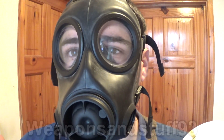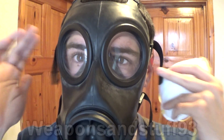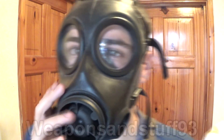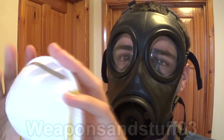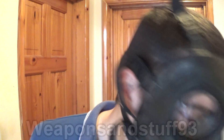Air follows the path of least resistance. With something like this, when you've got a filter on one or both sides and a really good weld to your face with the mask straps done tight enough and one that fits your face shape, you're going to get a really good seal. Whereas with something like a dust mask, you can never get one that sits on your face properly because of the shape — it's a one-size-fits-all thing.